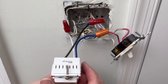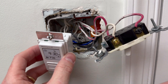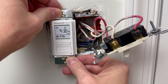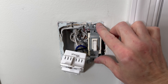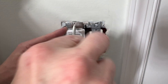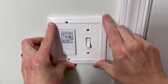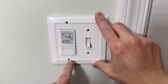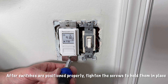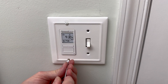With the three connections made, we're going to tuck the wire nuts back into the junction box. I've tucked them all over to the right side because the depth of this switch is shallower, which gives maximum depth in the junction box to push the programmable switch in. Now the interior single-pole switch is reconnected roughly where it should be. Make sure all the wires are out of the way, then attach the programmable switch. Before tightening it all the way, line up your cover plate and make sure both switches fit within the holes, the holes are lined up, and the plate is level.